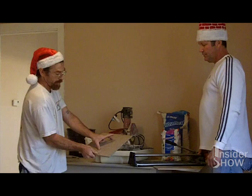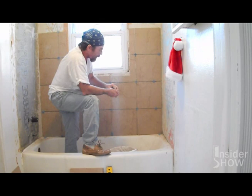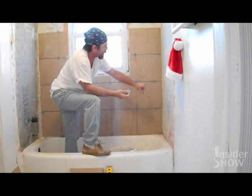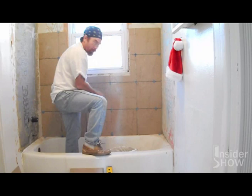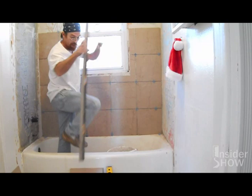I went ahead and made my pre-cuts for the ones I knew before I got here — it was going to be two and a half inches to go around where we're going to build out the window frame. I'm using these 3/16-inch spacers at the corners. These are handy little gadgets with an X to go in the corner, and you flip them over and there's just two points sticking up for any regular joint. It keeps everything nice and level — I throw my level on and that's right between the lines where I want it.